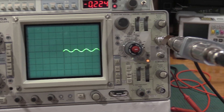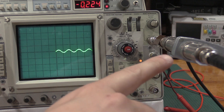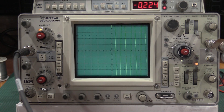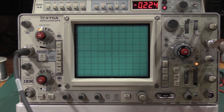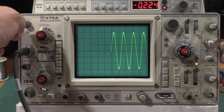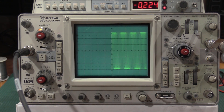Now we have to move this test probe to the B channel. This is a signal pickoff into a 10x attenuator into a 50 ohm terminator. I happen to have the right gender GR connector to make this setup work without any cables, so that's what we ran with. It's the exact same setup, probably going to do the exact same thing. We need to back this down and bump up the trigger sensitivity. We want to fuzz this out because that makes it easier to set the envelope.